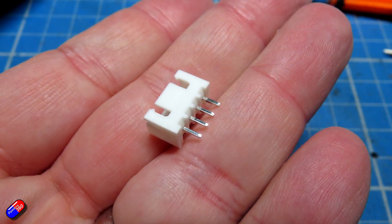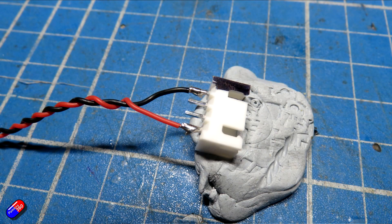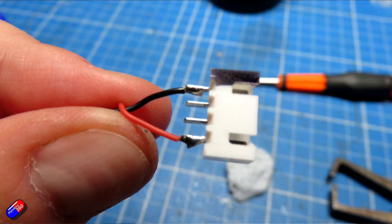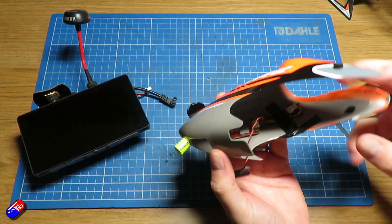The last thing was figuring out how to power everything. I'm using my old trick of tapping from the balance connector for the video transmitter. You can buy JST-style connectors for the balance tap from places like eBay. If you connect to the two outside pins — watch your polarity — that gives you the full battery voltage. It's a quite low current draw, but that's absolutely fine for this VTX, and it allows me to use the other connector on the battery normally. Then it was just a case of putting a little hot glue on the back of the connector, heat shrinking it so it's safe, and we're ready to go.